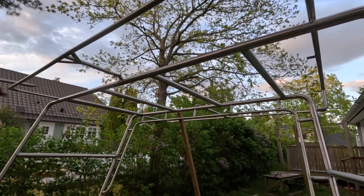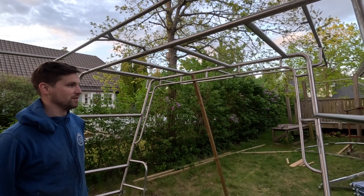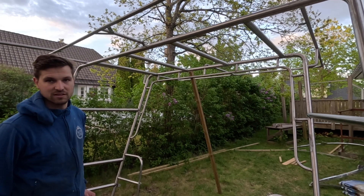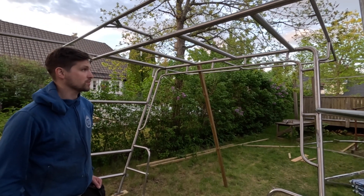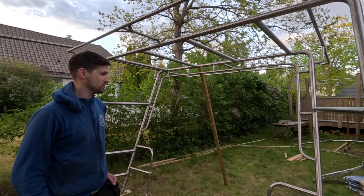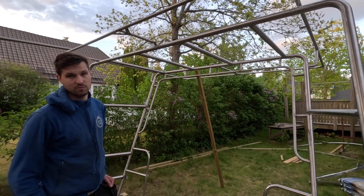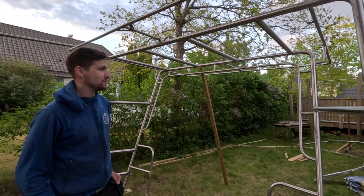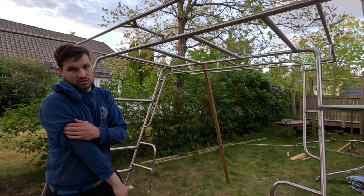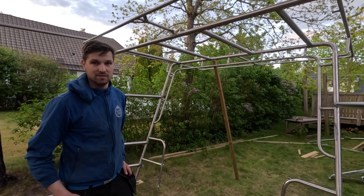Apart from that, I think we are satisfied. Obviously it's not super nice-looking welds and everything super shiny, but it will do the job and be nice enough for us. It will give us solar power. The solar panels we're going to mount are 585 watts each — they are gigantic, almost 2.3 by 1.1 meters. That will give us a bit north of 1 kilowatt of peak power. It's going to be super interesting to see how much it actually gives us. With this position and no other antenna mounts, we should have basically as little shading as you can potentially get — only the mast can shade it.